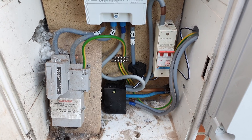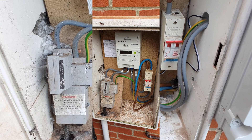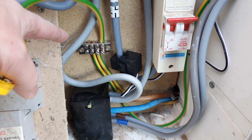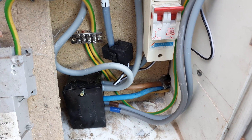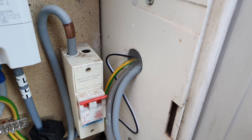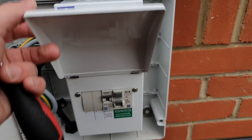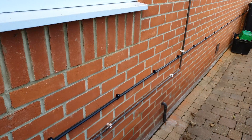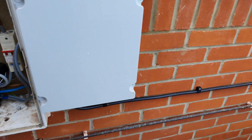Here's the inside of the meter box — a before-and-after comparison. After the install, there's a Henley block added, some new earth connectors, and a CT clamp. The cable goes through the side of the meter box into a fairly large external weatherproof box housing a small consumer unit, an RCD, and a 32-amp fuse. The EV ultra cable then runs all the way along the wall — a run of about 10 to 12 metres — to the front of the charger.